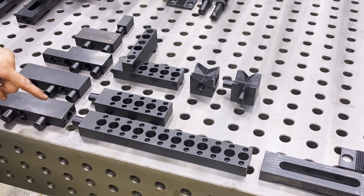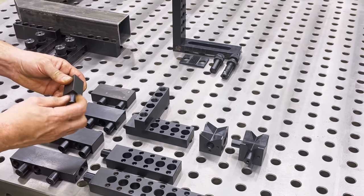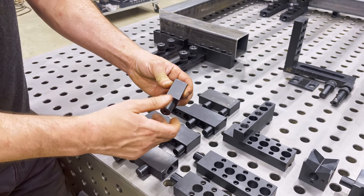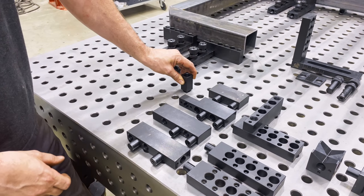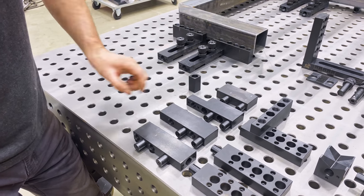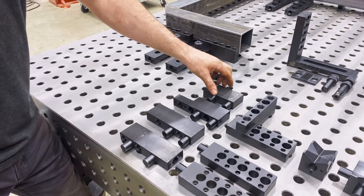As you can see they come in a whole bunch of different sizes. They're basically one by two bar stock and they have a pin on the bottom. Now this pin is removable on everything. The table uses a three-quarter inch hole and this is the pin that goes into the hole. This is a single pin fence block and it works by simply going into the hole like this. This is square — most other tables are round — so that you can actually clamp to it or use it as a riser block or a shim. And of course they come in different sizes.